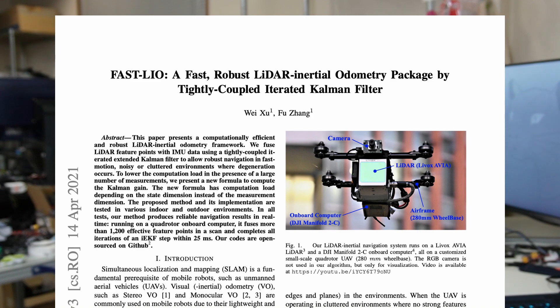Here is the point cloud topic: cloud_registered. This point cloud data will be accumulated from the first frame and keep adding up to generate a 3D map. On another terminal, I source the ROS2 environment and save the PCD file using a ROS2 service command. FastLIO will report saving the map to the specified location. We can then use the CloudCompare application to open this PCD file and see the 3D map we just generated.